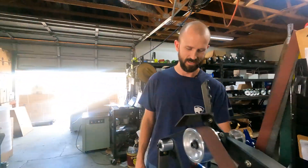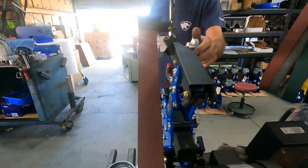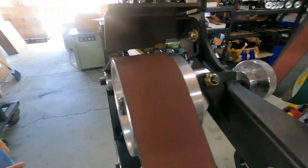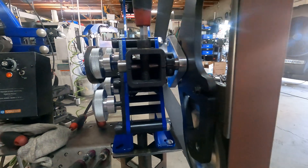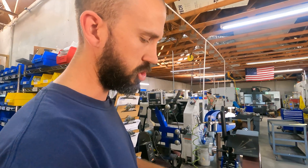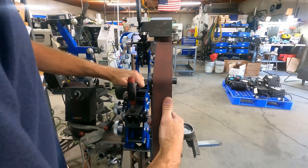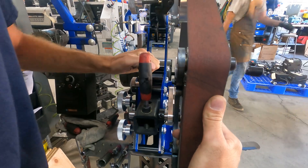This one was really good, so let's purposefully make it wrong. As you can see, when I've got the belt centered on the platen, it's running off to the right side of the tracking wheel. That tells me the platen is too far to the right. We would adjust our shaft collar away from the arm by the amount we want to come in, then slide it in up against that new position and test it out.